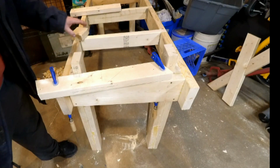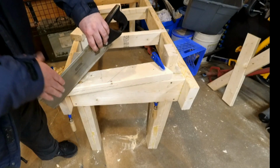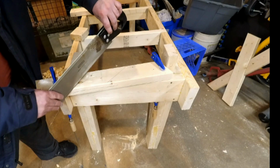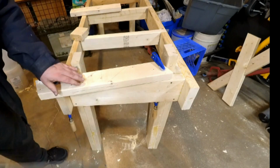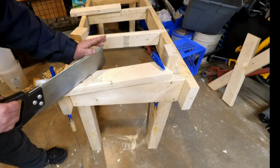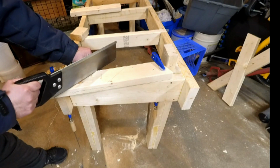And the idea with the sawing is that you want to go in this way, down, I'll show you this side. You go cutting this way down to the line there, so that you're not going to go too deep, and you're going to sight your saw along the line as you cut down. Then when you get down to the approximate depth, you start easing her back and cut down across the line to the approximate depth on the other side. That'll no doubt leave you with a bit of a Humpty Dumpty in the middle of approximately 12.73 degrees, and that's okay because you can go flat this way and cut it down until both ends are approximately where you need them. Now, this isn't what you would call fine furniture cabinetry or anything.